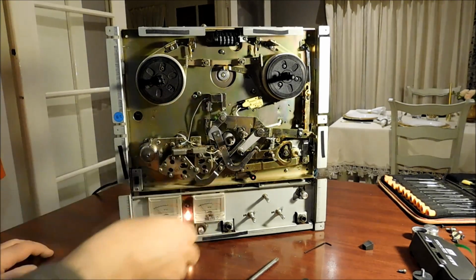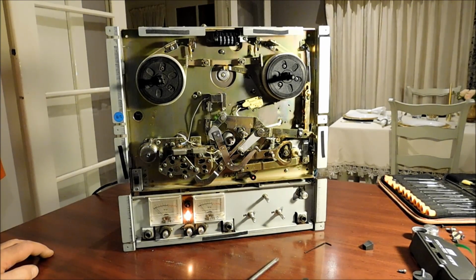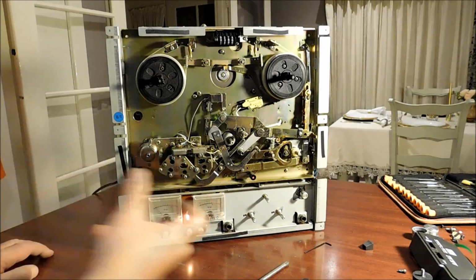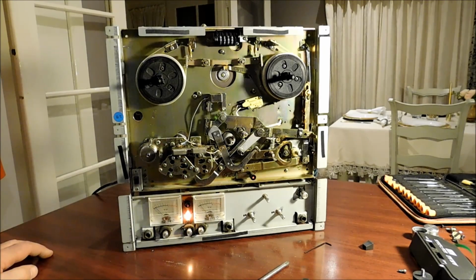Just clean off that capstan roller, this one here, and make sure this is clean. That's the pinch roller, and that, as I said before, determines tape speed through it. And we might clean that front fascia, because I don't want to spray things to clean the front fascia off when of course I can get that spray over the heads. I want to keep them clean.